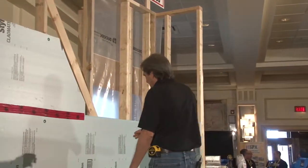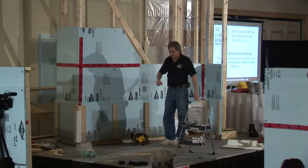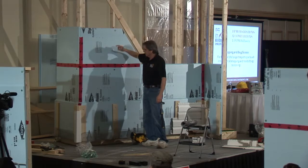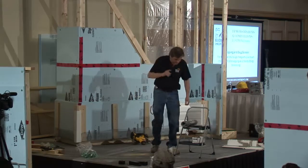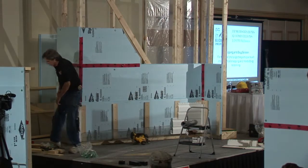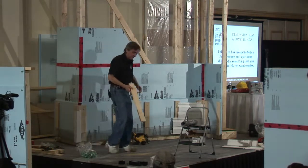Now what we want to do for the siding is put on some strapping. The strapping goes directly over the studs. That's what the guys were just setting up, making sure that the nails that hold on the styrofoam are on the studs so that we have something to go into. So there's a little catch about this strapping. It's a 1x4 strapping that we're putting on here.